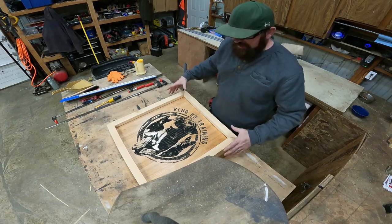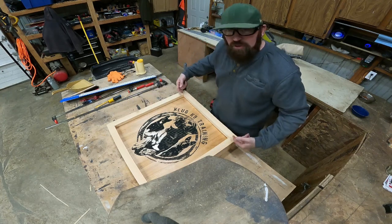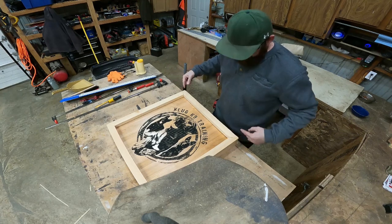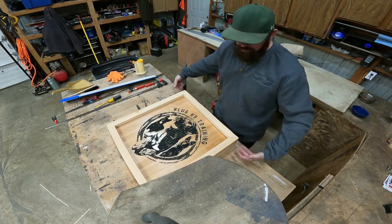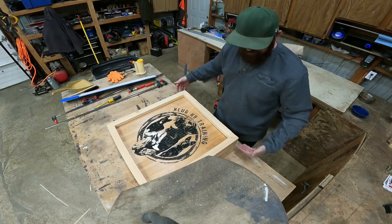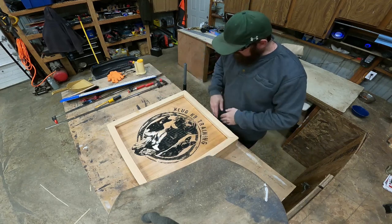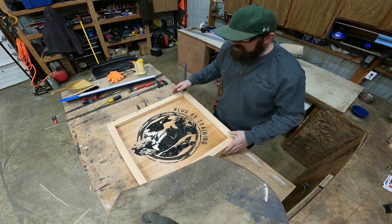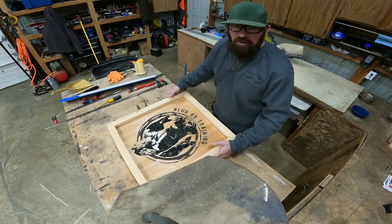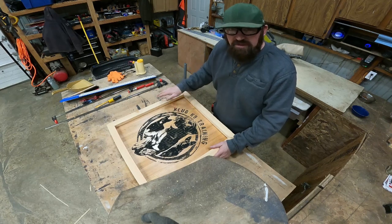What I'm gonna do tonight is go ahead and glue these corners. I'm gonna put a small thin bead of glue on the back side of the sign just so it helps keep things in place. Then tomorrow, we'll come back through and put some screws in here and countersink them, and then we'll cut off with dowel rod so everything's sealed up so the weather can't get to them. I'm probably gonna put the screws on the side here and coming from the bottom so that there's nothing sitting up here for the water to sit on and make them rust, because in the Pacific Northwest, we get a little bit more rain than everybody else. So let's get this thing all glued up, and then tomorrow we'll get it countersunk, and then we're gonna start working on the welcome and happy training signs that hang from the bottom.